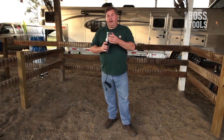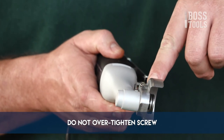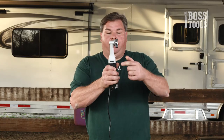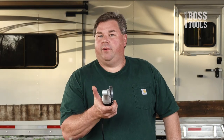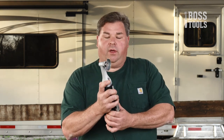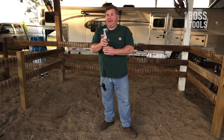As you can see, I've got my safety guard on to protect my fingers from the debris — I'm all ready to go. Just make sure when you tighten this screw, you don't over-tighten it. You want to stay below these air vents; if you block them, it overheats. The big thing about holding the Hoof Boss is you want to hold it in such a way that you have control — not too high, not too low. That way if the animal kicks, it doesn't fly back and give you a new mouthpiece.